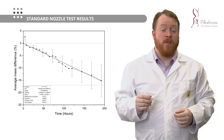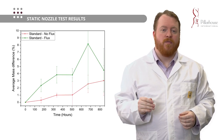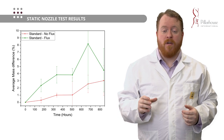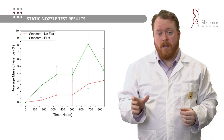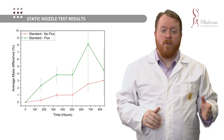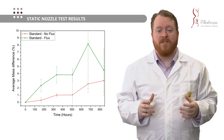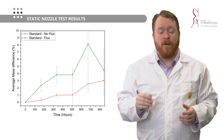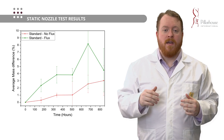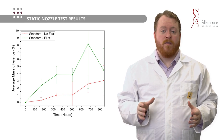Now we've analyzed the wear of nozzles with solder flowing through them, but we became curious about what happens when the nozzles are simply immersed in static solder — no movement at all. With this type of testing we determined that longer time periods would be better, measuring once per week — that is 168 hours between each measurement. The nozzles were placed in different baths: one was fluxed daily and the other was placed in a bath with no flux applied. We can see in both cases mass gain for these nozzles, but the nozzle that had flux applied gained far more mass — possibly due to the flux's cleaning effect removing dross and allowing more solder to adhere and form a reaction layer on the surface.